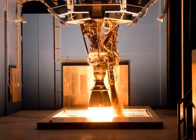In this configuration, the engine consumed 140 kilograms (300 pounds) of propellant per second. Tests have been conducted with a single Merlin 1C engine successfully running a total of 27 minutes across the duration of various tests, which equals 10 complete Falcon 1 flights. The Merlin 1C chamber and nozzle are cooled regeneratively by 45 kilograms (100 pounds) per second of kerosene flow, able to absorb 10 megawatts (13,000 horsepower) of thermal heat energy. A Merlin 1C was first used as part of the unsuccessful third attempt to launch a Falcon 1.